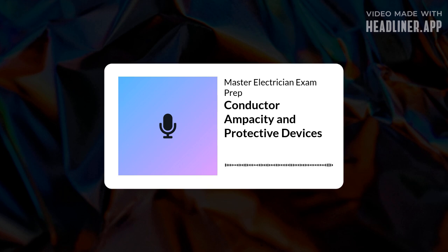Yes. Section 210.5(C) requires that the ungrounded conductors in multiwire branch circuits connected to different phases or systems be identified, usually by color coding or other durable means. Super important for safety, especially during maintenance. Helps avoid mixing up phases. Absolutely. Okay, let's get to the heart of it.